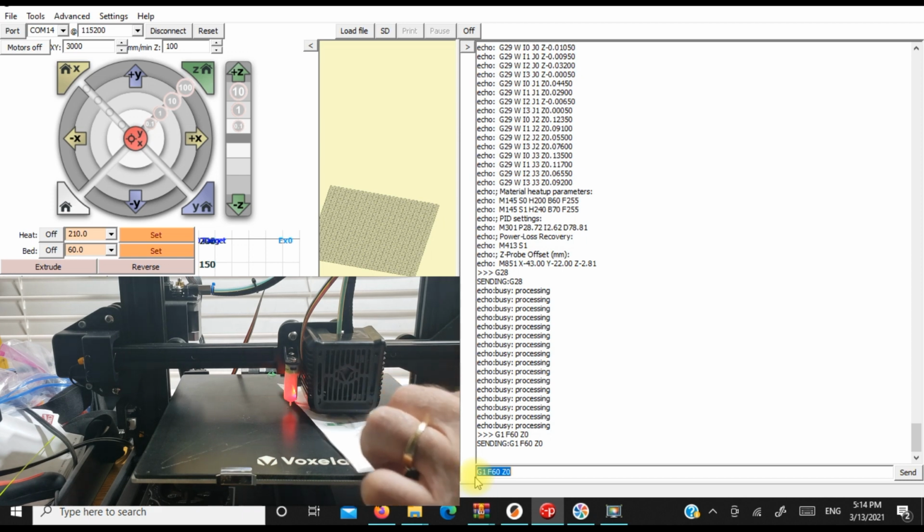So this is actually a really good trick to use with BLtouch or without BLtouch, just to find what your true Z offset is. And a big shout out to 3DMN for this tip. And this is a very good reason why using Pronterface helps out tremendously when troubleshooting.